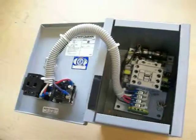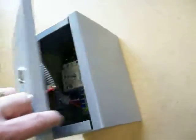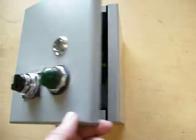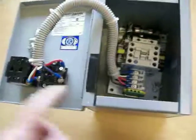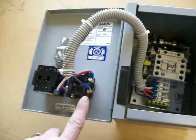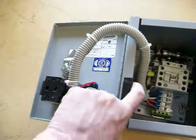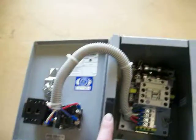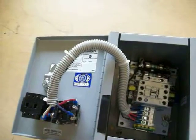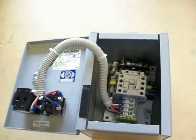It's just a little tight in a 6x8 box, but it works. See how the door closes and it curls around in there? We added a little insulator right here — these screws were just a little too close, so we put it on a self-adhesive insulating strip right there, just to make sure nothing happened. If you've got any questions, just give me a call. This is Moose, Moose Trading.